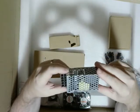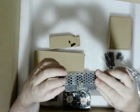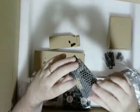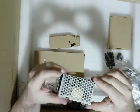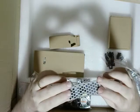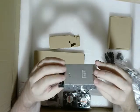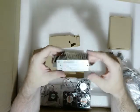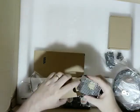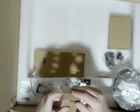Staring at it, I see a couple of filter caps. There's a few more on the downstream. I see a choke, main switcher. There's a fair bit of epoxy in there. Caps are shy, they have a little cover, so I can't see them very well. Don't recognize names. I can't cast aspersions on whether this is genuine or not, but it's not the worst attempt at a switch mode power supply that I've met. So there is a good chance that it will function as advertised.